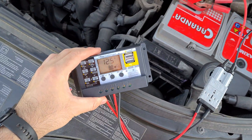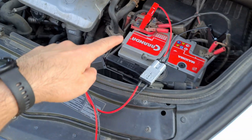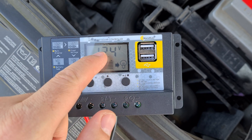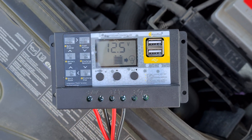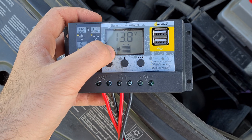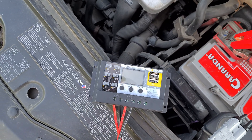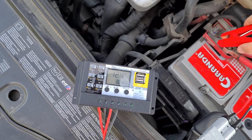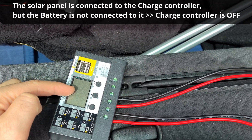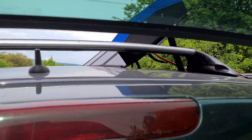So now I connected the charge controller directly to the car's battery — 12-point-something volts are in the car battery. This is not connected, so the battery can power a load and the battery voltage is 12.45. There is no 13 volts entering into the battery. So if the solar panel is connected to the charge controller it's not doing anything — the display is not on, the battery side is not connected. The solar panels are on the roof of the car.